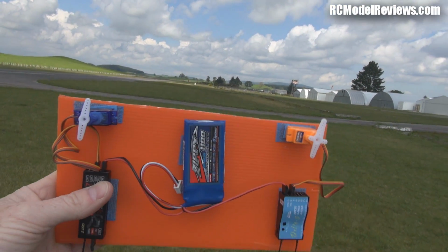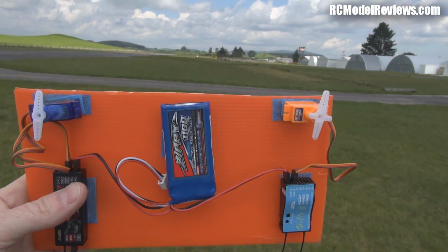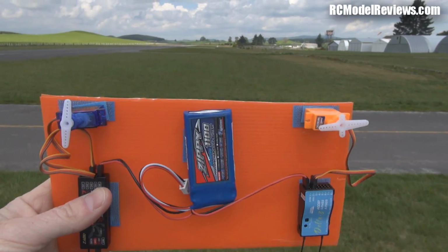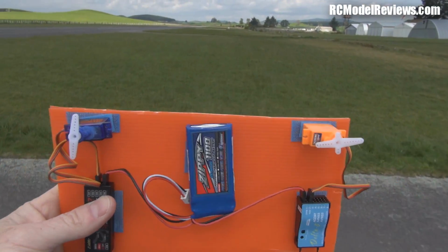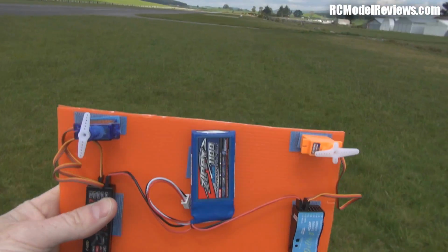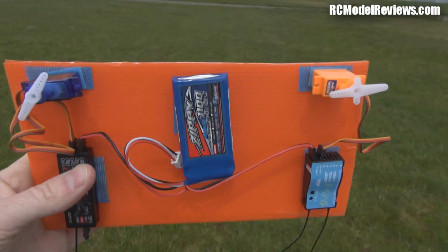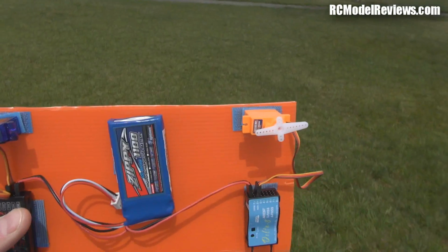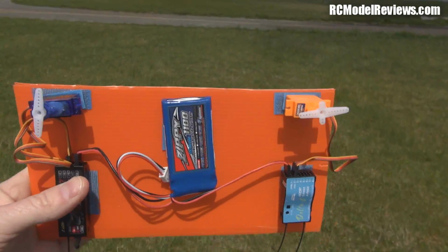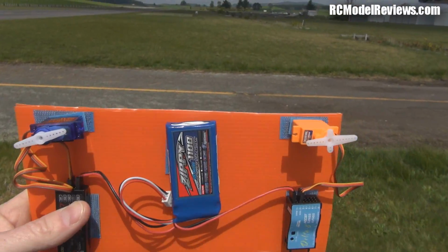And here we go. Now they're both dropped out. Oh, the FrSky's back in. So we had 35 meters more range. Oh, and we're still going in and out. That's astronomical. That's about 30%, or maybe 25% greater range from the FrSky receiver than from the genuine Hitec. I did not expect that. Now they're both back in range.